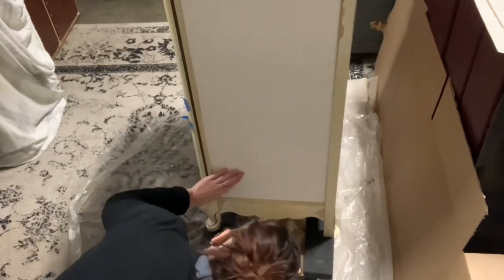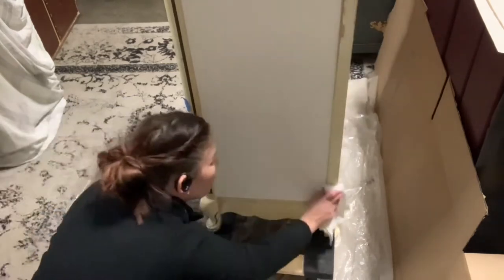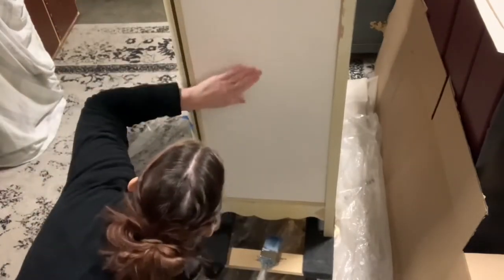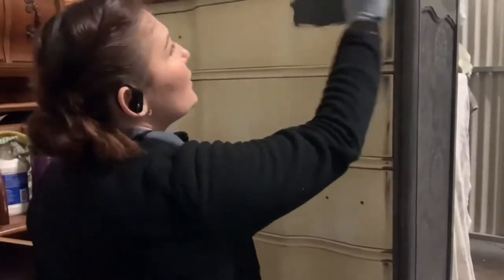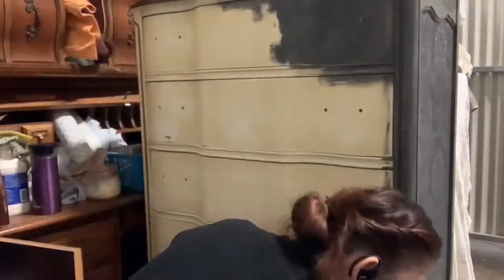You do want to wait until it dries 100% before you paint over it, because it'll just have moisture on the back side and then moisture on the front side, which will cause bubbling. But if you wait for the poly to completely dry, you won't have any issues. You can use a brayer, but on Anaglypta I try not to because it's textured and I don't want to squish any of that down.